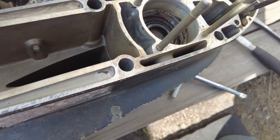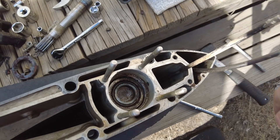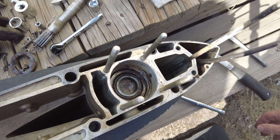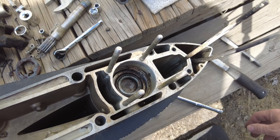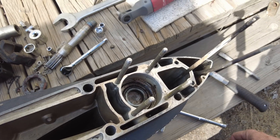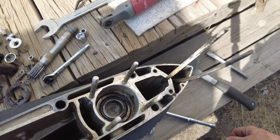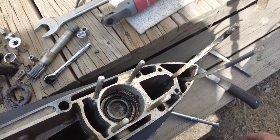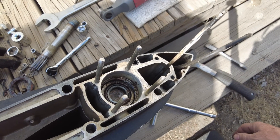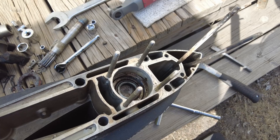The prop turns fairly good. I don't feel too much damage other than the fact that that top bearing is spinning — it seems to be welded right to the shaft. I think we're going to have to do a little bit of surgery here to pull the innards of this lower unit out through the back. Hopefully it should be just a matter of getting a new bearing, a new nut that I broke, and a new drive shaft — the cheapest one I've found so far is a couple hundred bucks, but at least it is available. Anyways, let me continue with this teardown a little bit and I'll bring you back when I've made some progress.